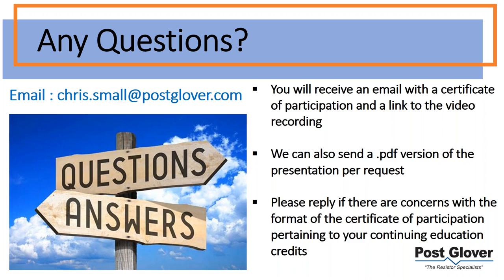Another person in Indiana asked, if I were to use a 400 amp 10 second resistor, would it always go all the way down to 240 amps when there's a ground fault? No. If they test consistently, then technically if you waited 10 seconds, it would get down to the rated current eventually. That being said, there's going to be a wide variance in how long you're going to be staying online. Probably very short, which means you're going to be much closer to the original current. So the answer is no, but it depends on how long you let the resistor have a fault in there.